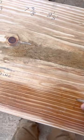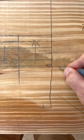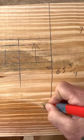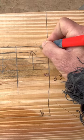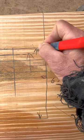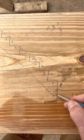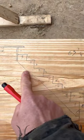with your stair hole, what you're going to do is measure off the front of your header 63 3/4. From the header of your stair landing to the front of your new landing that you're building, it has to be 63 3/4. That way your tread can terminate right here and terminate right here. So this distance here is known.